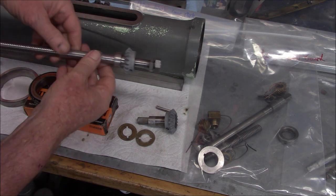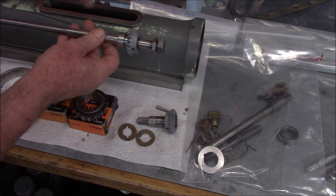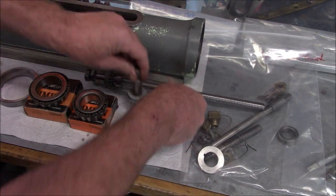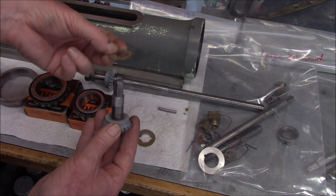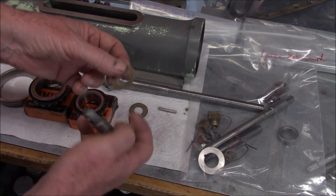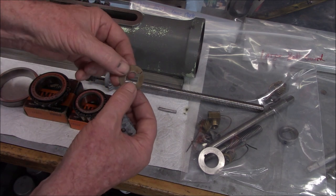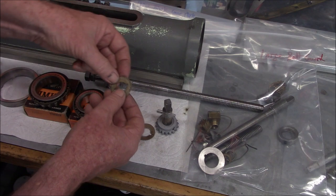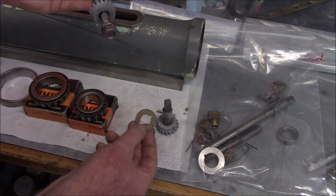This is the ram adjustment lead screw for positioning the ram after you've set the stroke. Everything here looks pretty good; gears cleaned up nicely. The gears are backed up with kind of a fiber paper thrust washer — this one goes on there and you can see there's a slight problem with this one. I don't know what kind of material this is; I'm thinking of trying to duplicate these with brass shim. These are 25 thousandths thick — I've already measured them. This one here is still okay; it goes on the back side of this one. But if I'm going to duplicate one, I might duplicate both.